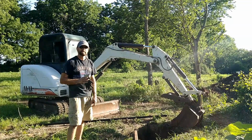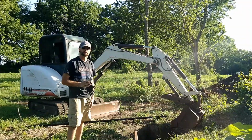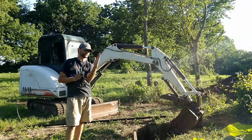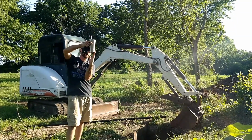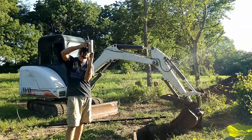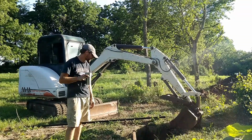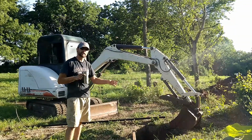Well, I thought you said there's a cavity down there. Only like 8 feet down. Down the bottom is nothing. Oh, okay. So the problem is the pipe is sitting in the well like this now. As the packer comes down, it's going to be outside. There's no way we're going to be able to get past that. It's just going to hit the PVC and get stuck. I was thinking we could slide it faster. But you don't know how wide it is 30 feet down, though, right? No, it's a 6-inch casing all the way down.